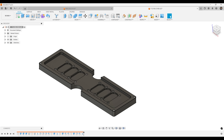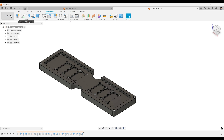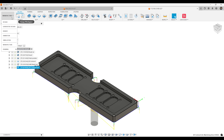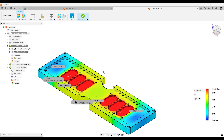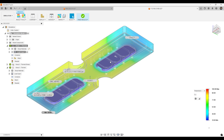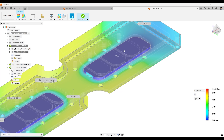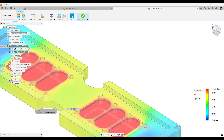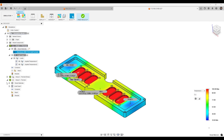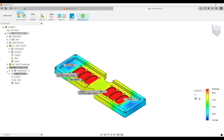In design, you can do sheet metal too — I've done sheet metal work and manufacturing. With this part, you have data on what temperatures are going to be put into the battery pack areas, where the chiller is mounted, and where it's going to be cold versus hot for the batteries. We did a thermal simulation test. We made it out of aluminum, but the customer also wanted a study done with magnesium to see how temperatures would differ. Being able to do these studies and simulations helps out a lot.